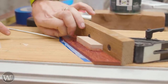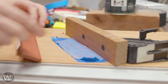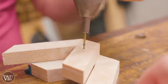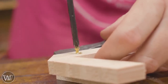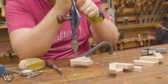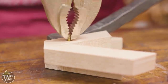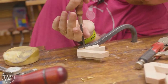We can take a look at how the tape-and-glue stop comes off — it's really surprising how strong it is between the masking tape and the glue. A lot of people use this for patterns, but it's a bit thick for that; for temporarily gluing down stops and blocks it works great. Masking tape on either side, superglue in between, and you've got a really nice strong bond that peels up clean. Once the glue dried — it wasn't quite strong enough — so I'm going to put a screw in these. These are just test subjects. I need to pre-drill, countersink, and put the screw in. They're brass so one broke off — I used wax but it still broke because they're tiny little brass screws. I used a little more wax and put another one in. Now we have three W's that are glued and screwed together.